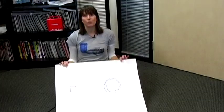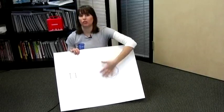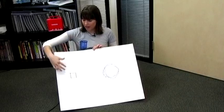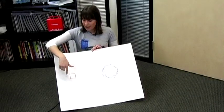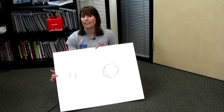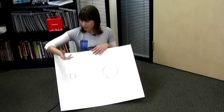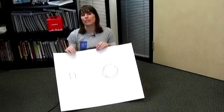Here we have both of the squares drawn by our robots. This one by the Scribbler in blue — you can see it's kind of chaotic and all over the place; it wasn't really able to draw the same square each time. But the S2 square has nice straight lines and nice 90-degree turns. This is all thanks to those encoders on the S2, which allow both motors to move at the exact same speed, giving us a nice, repeatable path. The only variance in the lines is due to abrupt changes in motor speed. You may have noticed the S2 moved a little more slowly than the Scribbler — that's because to gain the high precision the encoders provide, we have to sacrifice a little motor speed. Keep that in mind if you're porting code from the Scribbler to the S2; you may need to increase the run time of the motors to achieve your desired result.